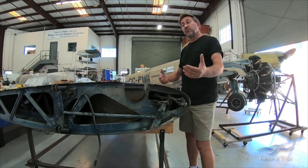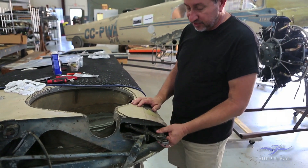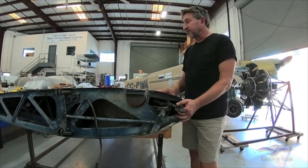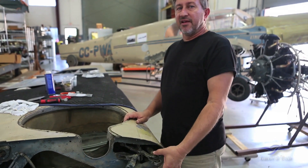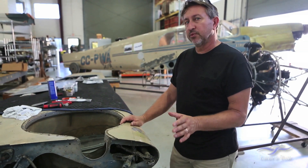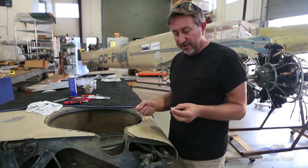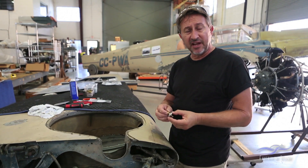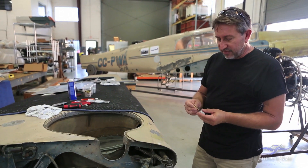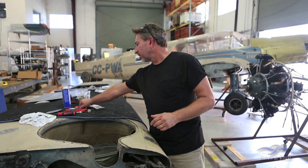What I've been doing lately is removing a lot of the internal components from the wing. We're going to remove this push rod, which is part of the aileron system on the 108. I've taken everything out of the left wing and it's taken a lot of time because all the bolts that go through a bearing on the 108 are a close tolerance bolt — a very, very tight fit. Unlike a regular AN4 bolt in an American bearing which you can get out pretty easily, I actually have to press out a lot of the hardware on the 108.